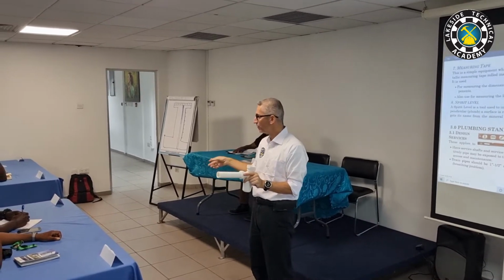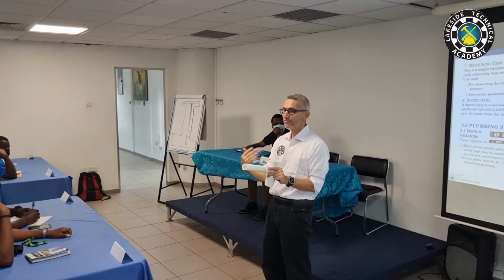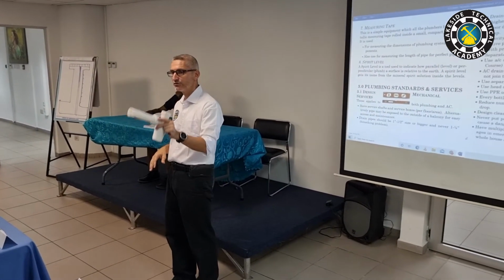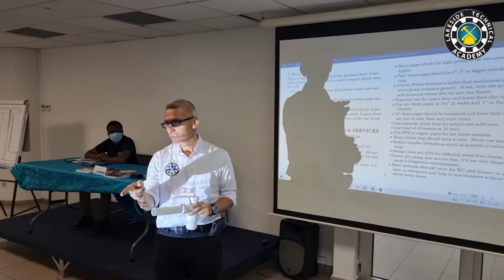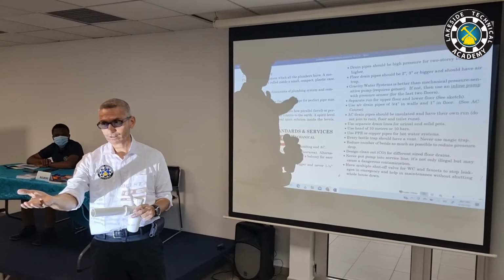Because I have realized if I have two sinks and a urinal, and the water is flowing, it doesn't flow very well. It has a breathing problem. So in our standard, it's always 1.5. That's our own standard. Not Ghana Building Code standard, not UK standard. That's why we say here we are doing our own standard. And I hope you are doing this at Orca House. Right? This thing we talked about a long time ago.